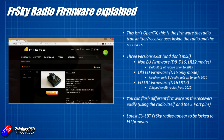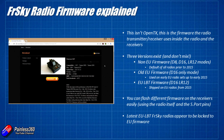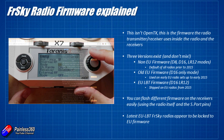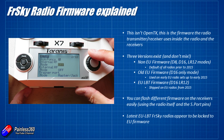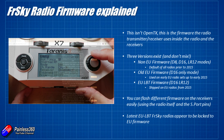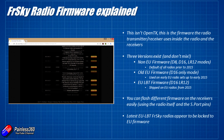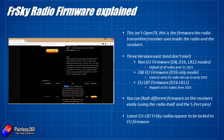The versions of firmware running on this thing can be one of three things. There's the non-EU firmware — this is what all radios shipped with originally, and it was a lot easier back then because there was none of this confusion. You could tell you had the non-EU firmware because in the mode selection you could pick from D8, D16 or LR12 modes. Then for a brief period there was an older EU firmware that nobody really uses anymore — that only gave you D16 mode, so you lost D8 and the LR12 long-range modes as well. You don't come across that very often because it was only around for a very short period of time.